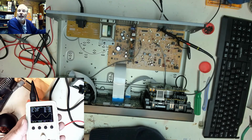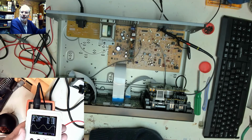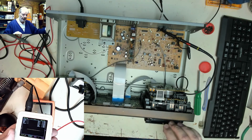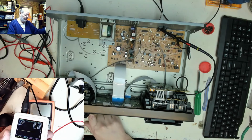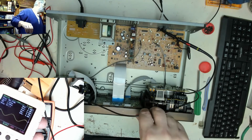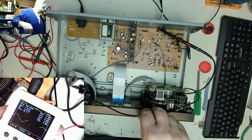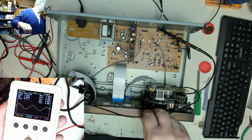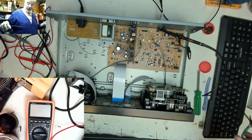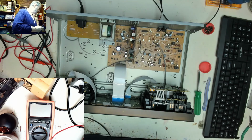And see, 970 hertz. Nice sine wave, as near as we're going to get to a kilohertz. I'm not going to adjust speeds on these decks. 980 hertz, as far as I'm concerned, that's as close to a kilohertz as I can get. I'm not 100% sure of the accuracy of that, but I know that test tone, what I was looking for more was constant.